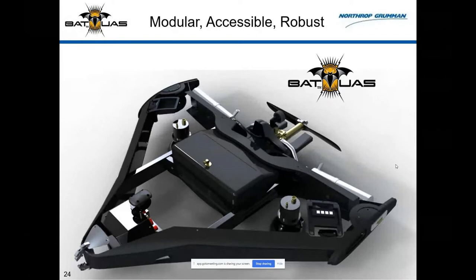I'm taking the pieces apart. I've taken the outer skin off. You can see the front spar and the rear spar. You can see the rails that support this tank. There's other rails out here supporting, in this case, two turrets that we were going to use. This is the interface control panel to test everything on the ground before you launch. This is the vehicle management box, the GPS, and the autopilot power management systems.